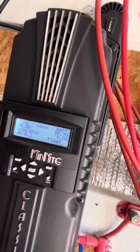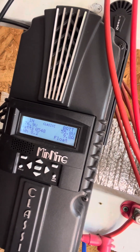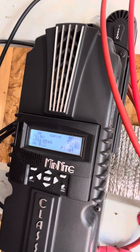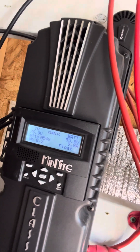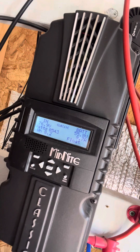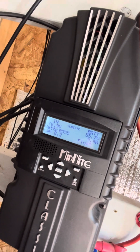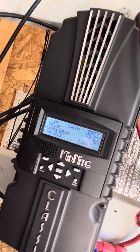We try to let it get to at least 48 volts before we turn the hot water heater on. If the inverter gets down to 42 volts it does kick off. If your inverter kicks off to save your batteries, the charge controller will still keep feeding energy into your batteries. Keeping it above 48 volts means the system won't kick off, but if it does happen you just turn the inverter off and back on — we try to avoid that as much as possible.